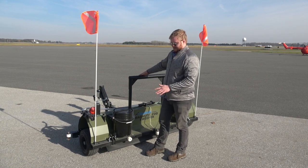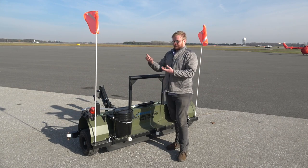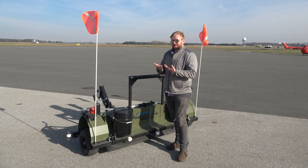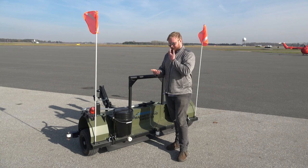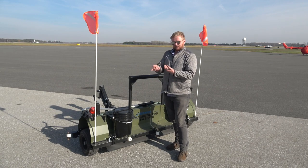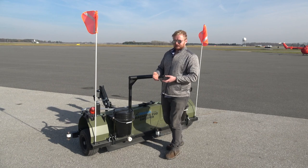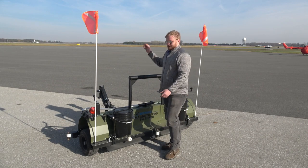With these magnet assemblies, the way they're built is an alternating pole assembly — think of it as two six-inch-wide magnets. One has the south pole pointing down and the other has the north pole pointing down. They pull on each other and create a very concentrated magnetic field. In that three-inch operating range, you can run this thing up to 30 kilometers an hour.